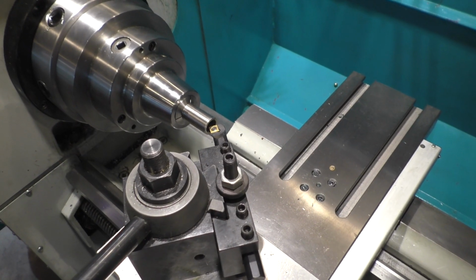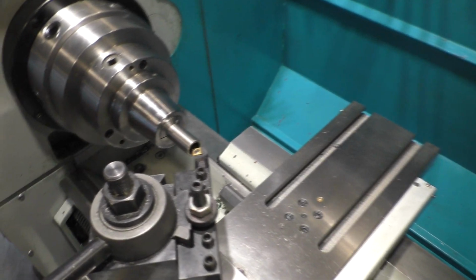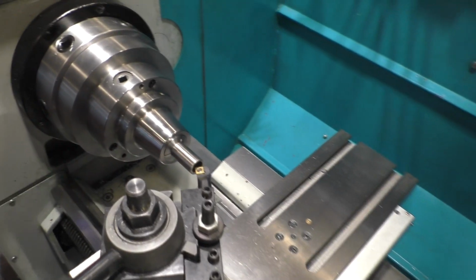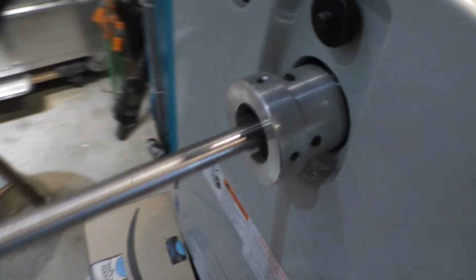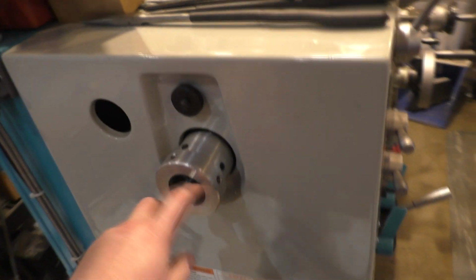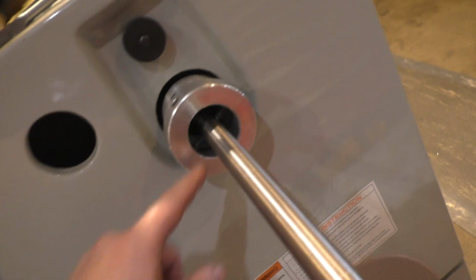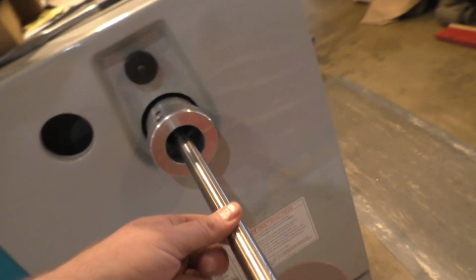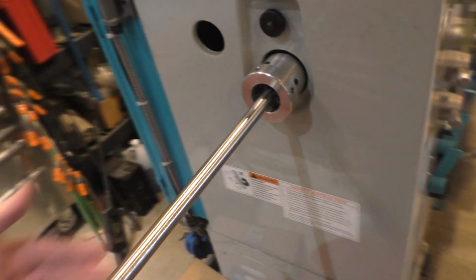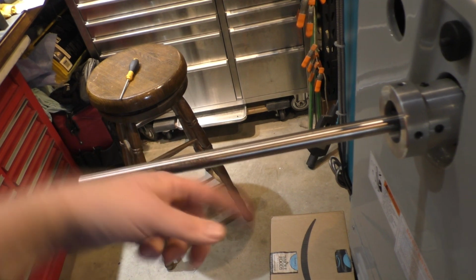All right, so deburring is not a big deal on the pipe like this. They provide me with the 5C collet to the exact diameter of this material. It's an odd size, so I did not have it. But the interesting bit that I thought I'd mention at least is the lathe spider. So I put in 4 Allen screws, and they have nylon bushings on the ends to gently hold the material, because if you let the stock just stick out, it'll beat the through tube on your lathe up, and the material can bend.